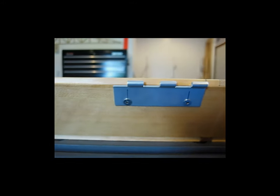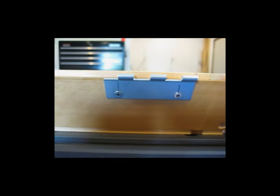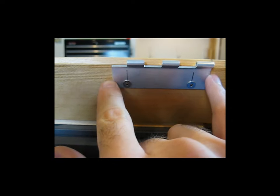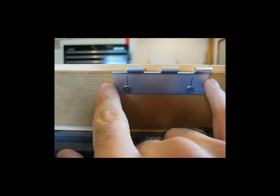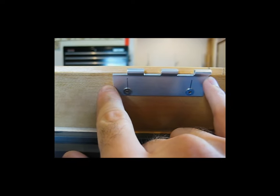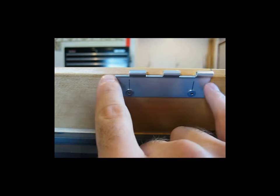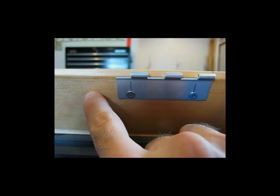I'm going to have three hinges per aileron. This particular hinge is the center hinge. I've made my hinges three inches wide. That's not critical — they can be bigger, maybe smaller. I don't know if I'd go any smaller than three knuckles, but I'd go bigger.